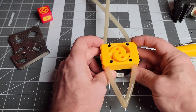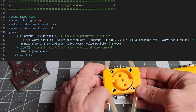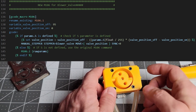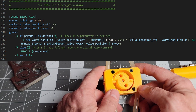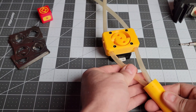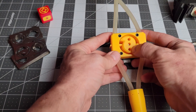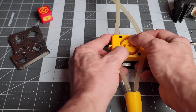Now the tube is fully closed, and now the tube is fully open. The way I have it set up in Klipper is that it always assumes the zero position is fully open. At the end of the print job, regardless of the state of my stepper, I always go to fully open or 100% cooling. Really simple and easy to connect to your splitter — air coming in and then both tool heads get an equal amount of cooling depending on what you set in your G-code.